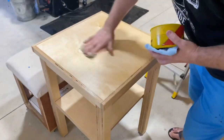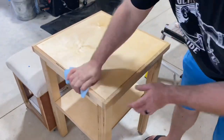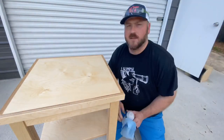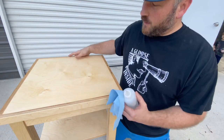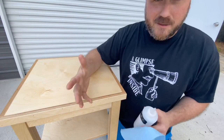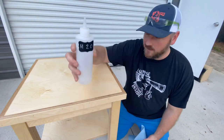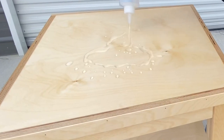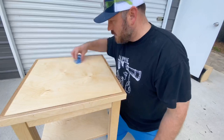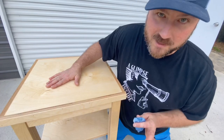Moving on to finishing up the tabletop — I'm going to put a light coat of paste wax on this. I simply rub a coat on, wait about 10 minutes, and buff it off with a nice cloth. The reason I put paste wax on flat surfaces, especially if they're going to have drinks on them — we're outside here so the ground is sloped for this illustration — paste wax makes water bead up just like a freshly waxed car. Since this is going to be a sitting table with beverages on it, I think that's a must.